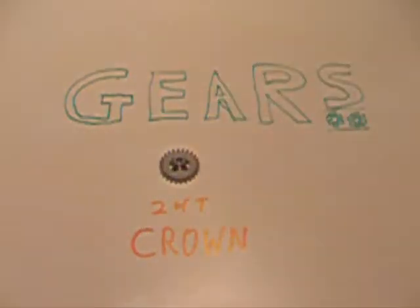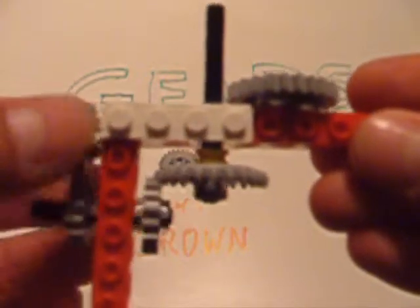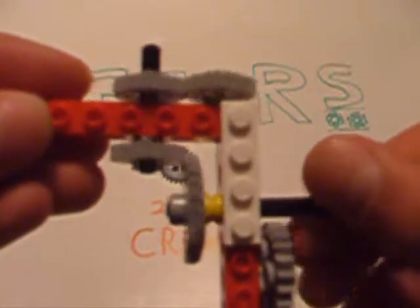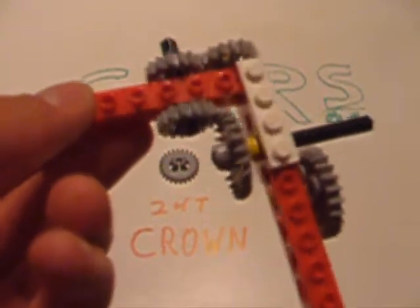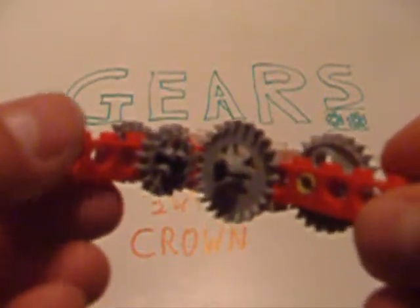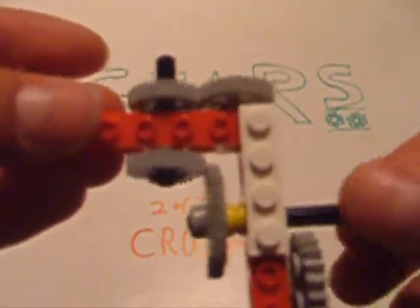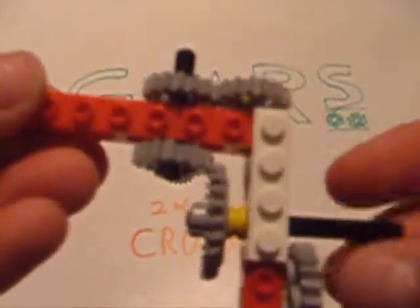If you take a closer look at the sub-assembly here, you can see what this gear is truly capable of. Crown gears are the first member we've looked at that enable you to change the direction of motion. Before, with straight-tooth gears, you could only have motion in a lateral or two-dimensional plane. Crown gears now introduce a third dimension — while I have motion coming in in this direction, it comes out in this direction.